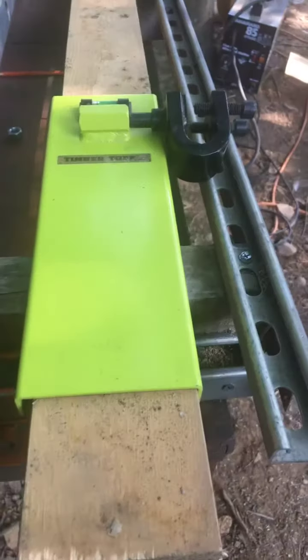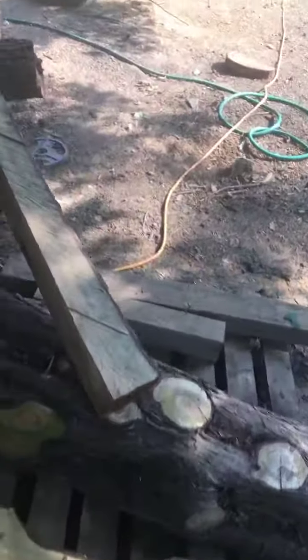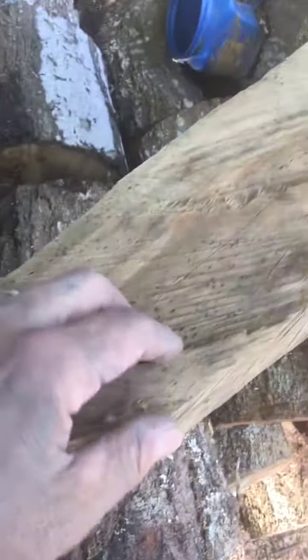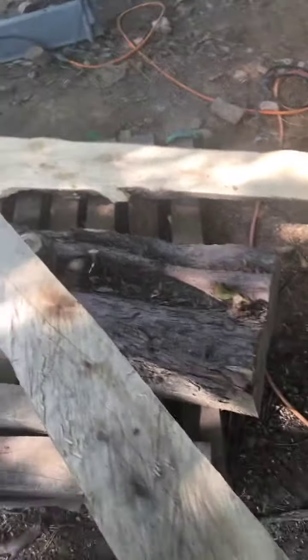So when I'm cutting and if I don't have that thing 100% straight when I'm cutting, this is what I get. We see a gouge right here and this is from where it's not cutting straight. I have another gouge here, I have another gouge here, and if you flip it around you can see we have gouges and gouges and gouges. This could have been a good beam but the problem is I couldn't use it.